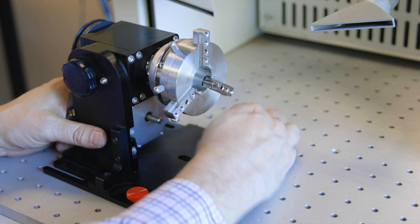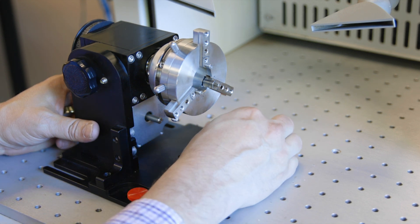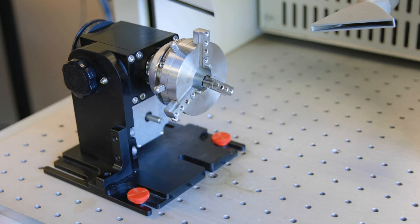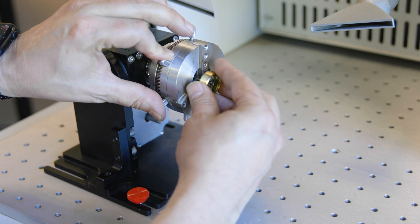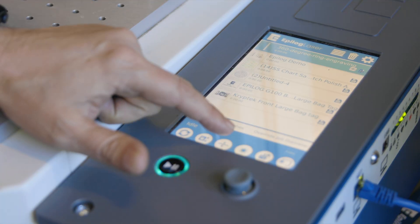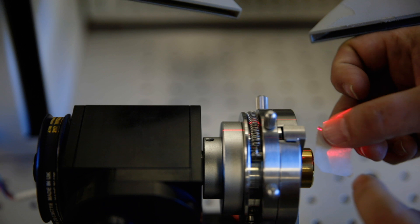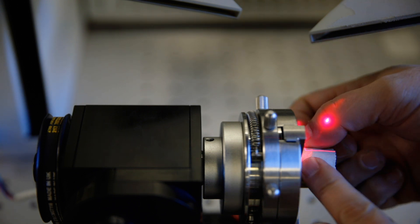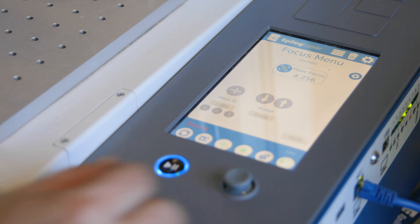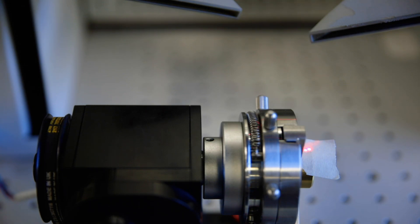Now go ahead and position the ring approximately over the center point of the laser — we'll be able to move this later. Turn these posts so we can put some outward pressure on the ring and that'll hold it in place. We'll turn on our focus. It's kind of hard to see where the focus point is on a material like metal, so I use a piece of tape often to be able to find that perfect focus point. We'll raise or lower the table until the red dot pointer comes in contact with the crosshairs and we'll know we're perfectly in line.